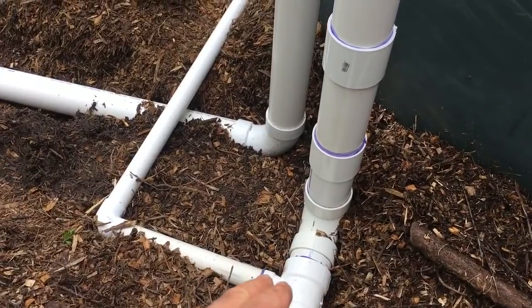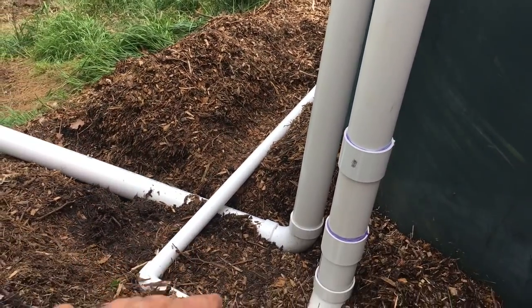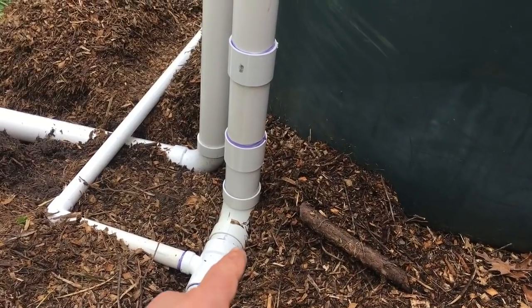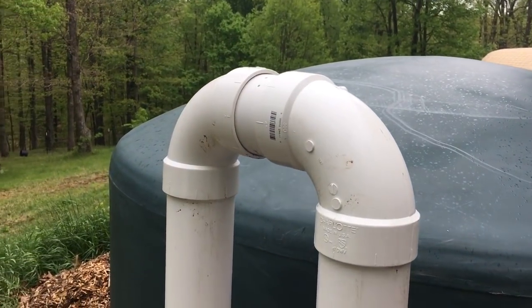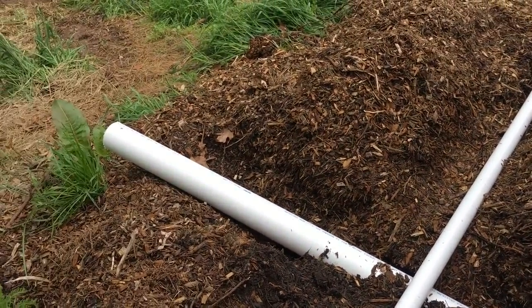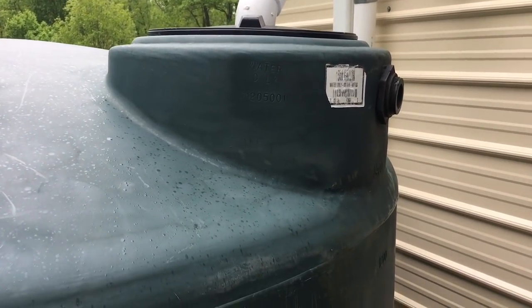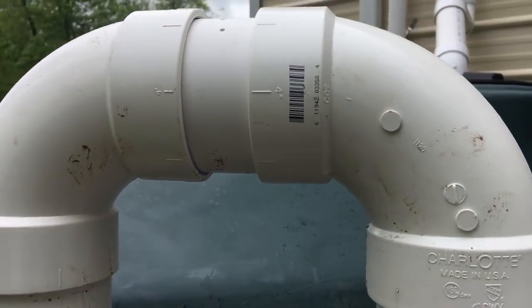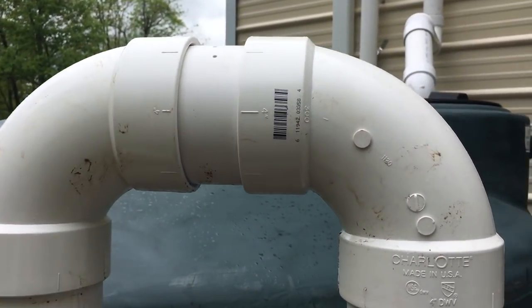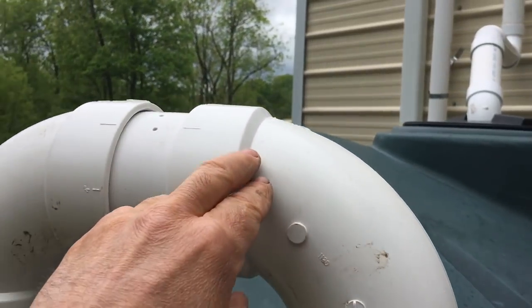Back to our four-inch pipe — it tees off with a two-inch that goes above the four-inch pipe, and I'll cover that one in a moment because that's where I'm actually using the water. The four-inch comes up with a 90-degree angle right there, comes up to the top, does a U-turn, and goes out and over. The purpose of that is so that when these tanks get filled up, they don't overflow right here. If you notice, the bottom of this U-turn is below the top, so if I get too much water close to the top, it's going to fill this pipe up and go out.